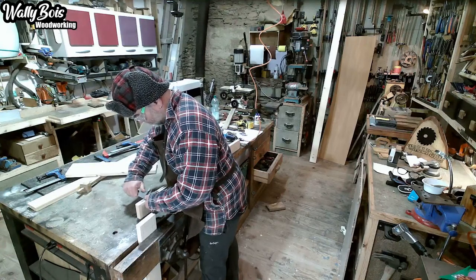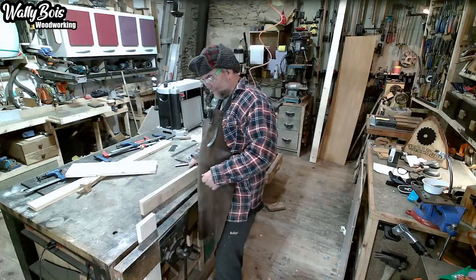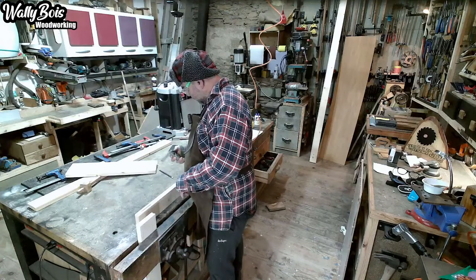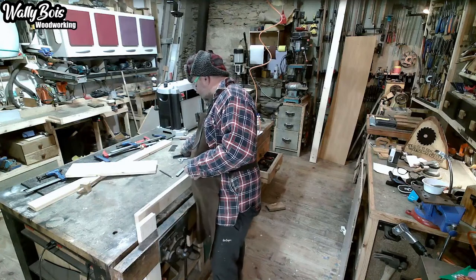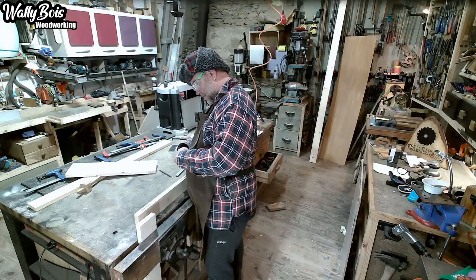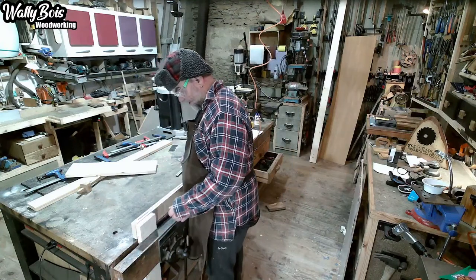We can clean that with a chisel. Yeah, so 10mm. Do you know why it's a bit shy? It's because I had to grind that hollow chisel up, and it's probably got a little bit smaller than 10mm. Or maybe it's a 3/8. It might be imperial, that's a possibility. Let's have a look at that. Yes, it is. 3/8 is a fraction. Yeah, it's a 3/8 chisel. It's not a 10mm, that's a 3/8. That's imperial. Anyway, let's mark that across there, which is done.